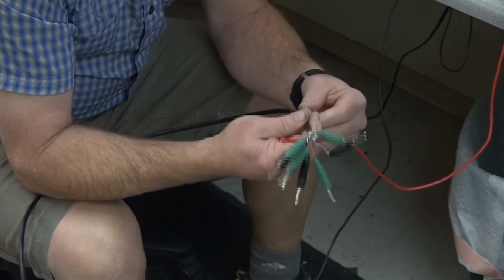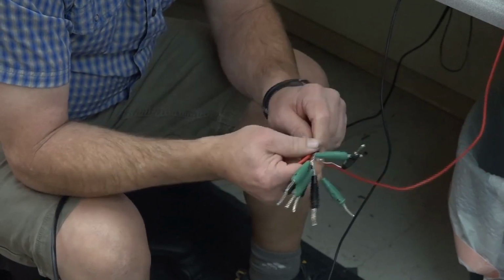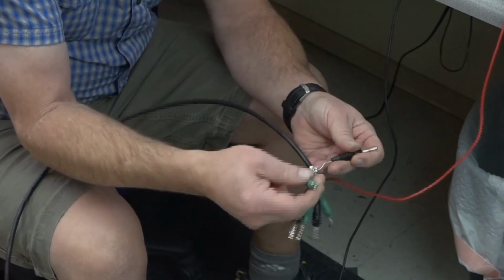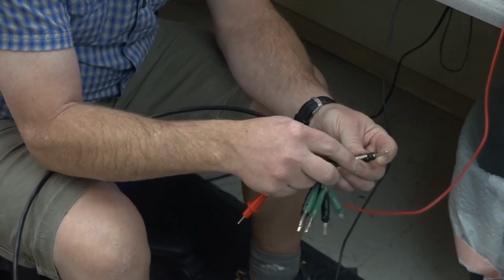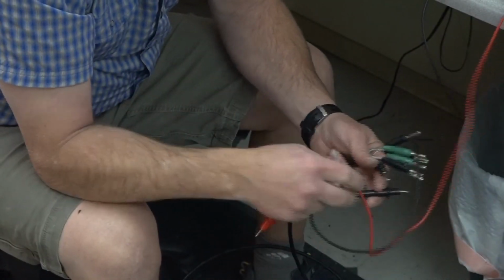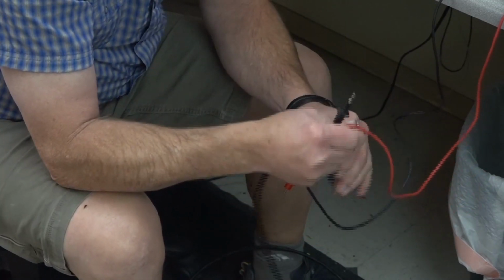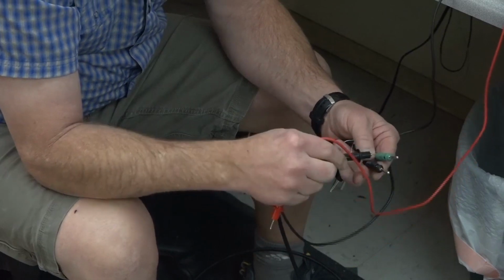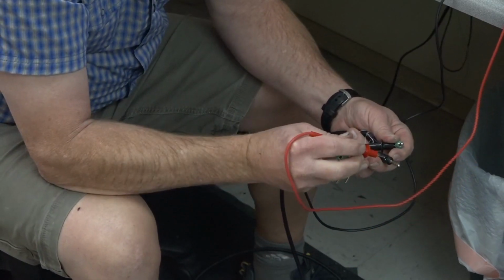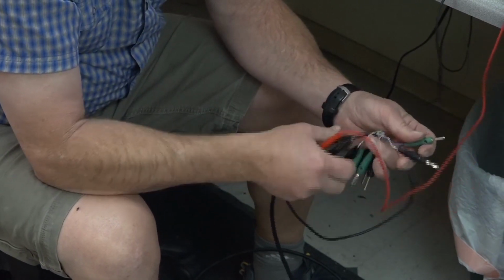So after you finish your long cable, of course you won't be able to do that on the long cable, so you can check the continuity by taking your blue and blue-white, tie it together on one end, and then go down to the other end of the cable with your ohmmeter, and you can then find your blue and blue-white cables on that end, and you'll find that you've got continuity on there. You can do that to all 4 pairs.